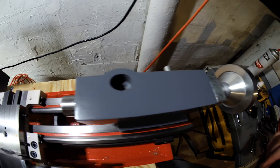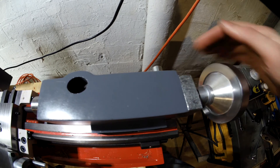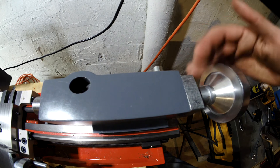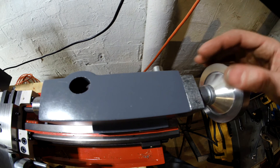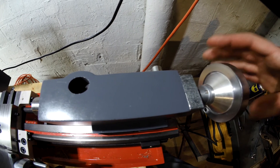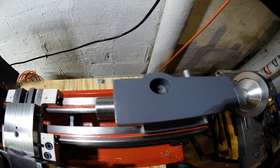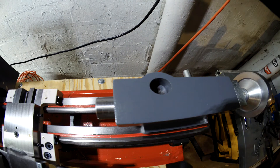As I was putting it back together, I left these four bolts here loose, ran this all the way back till it stopped against this, then ran it back forward about a millimeter and a half, then tightened these down. Checked it back and forth both ways — it's nice and smooth. Now let me get my chuck and put it in here.